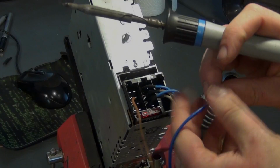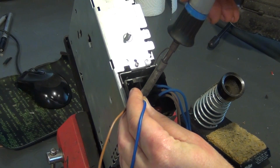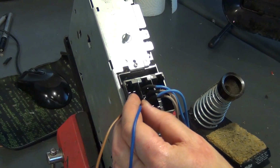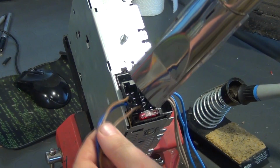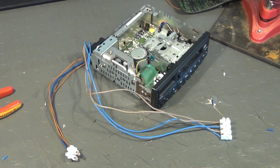The next thing I do is to solder wires to the pins of the power supply and the loudspeakers. I use salvaged wires from ordinary power cords, as I do in basically all of my projects. Since the pins are sitting close together, heat shrink is also used to prohibit short circuits that could occur while bending the wires during the installation process.